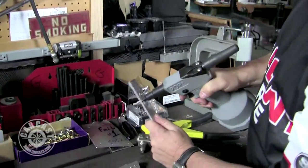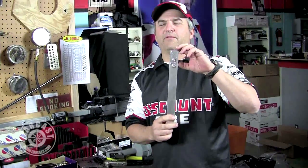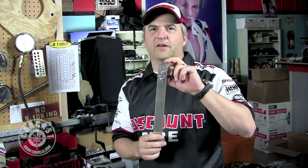If you're going to put hundreds of these in a body panel, you'll probably want to get an air gun. Let's hook that up and show you how easy it is to go automated with a little bit of air pressure. If you're going to do more than a handful of pop rivets, get an air gun — it'll make your job a hundred times easier. For moisture applications like marine work, you'll want the closed-back ones, which are completely sealed and keep moisture out.